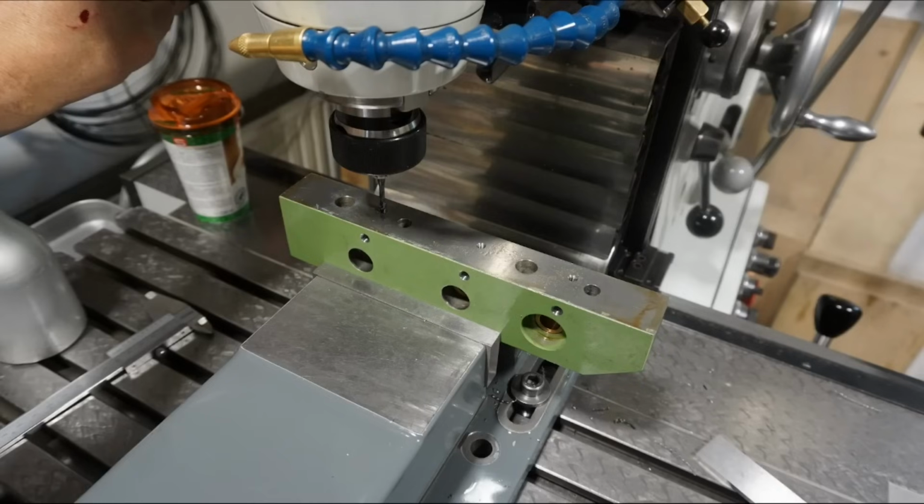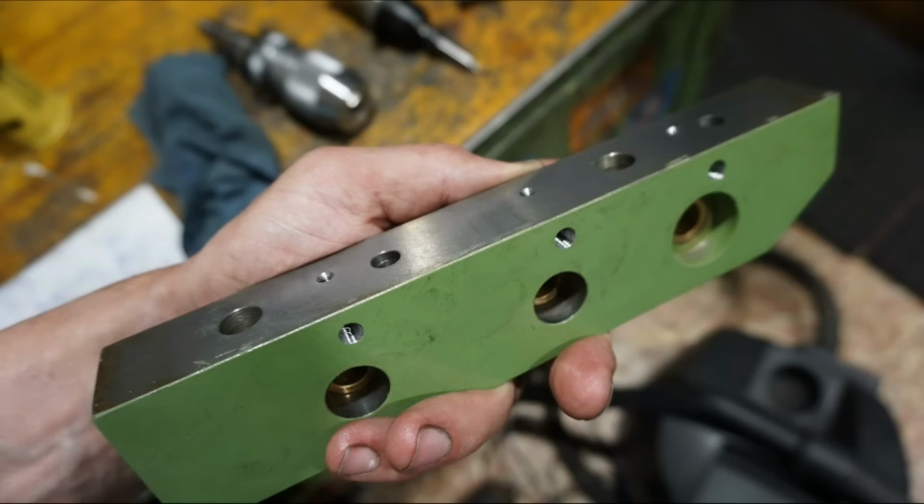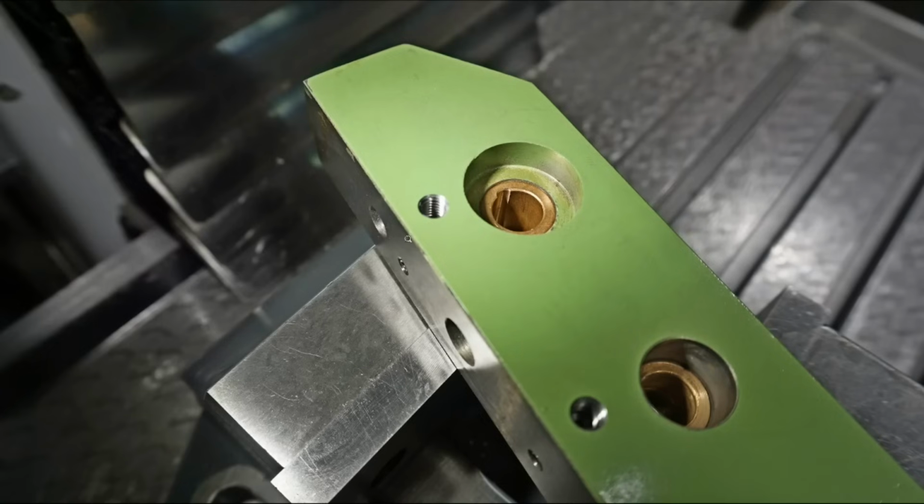And this bolt here just makes sure that this doesn't rotate to the left too far, because then that function wouldn't work anymore. Moving on to the bracket that holds the right end of the lead screw here, I drilled and tapped these holes, this one here, 2, 3, and these 3, so that we have sort of an L-shaped passage of oil into these bearing points. This one in the back here gets later plugged with an M4 set screw. So here 1, 2, 3, 4, 5, 6 holes. And you see here plugged with a set screw, so the lubrication fitting goes in here. Oil is routed to the center bronze bushing, and I also machined this slot in here so that the oil can wick nicely all the width into that center bronze bushing.